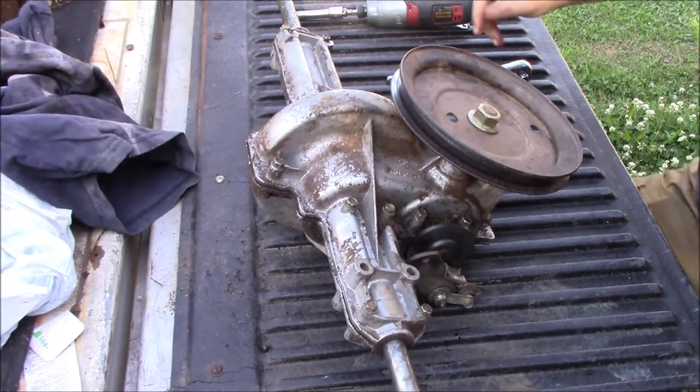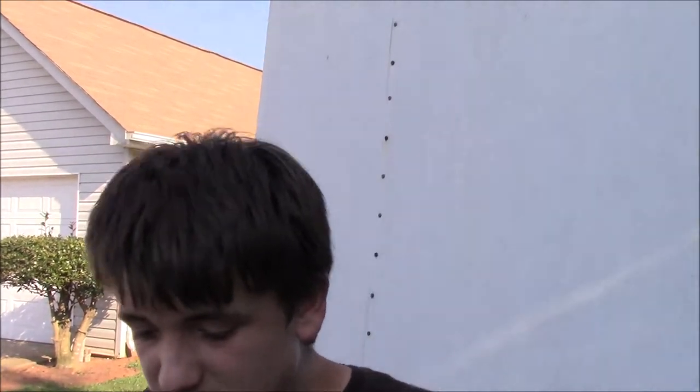Okay, so I know that was a lot and it may have been confusing at times, but basically this is a transmission and a differential in one and I went over the basics of both. You have a drive gear, you have forward and reverse - those are the two gears I showed you on the back, the ones that had a lot of play in them. Then you've got the big pinion gear which actually spins your axles, and that one has tiny gears inside of it that control how fast your wheels spin. Of course in a lawnmower you don't have anywhere near as big of gears as you would in a vehicle, so it's slightly different, but it is the same concept.